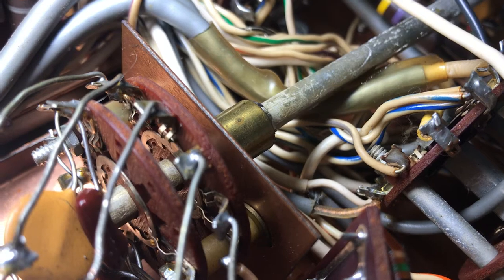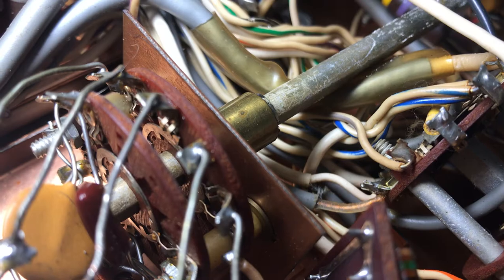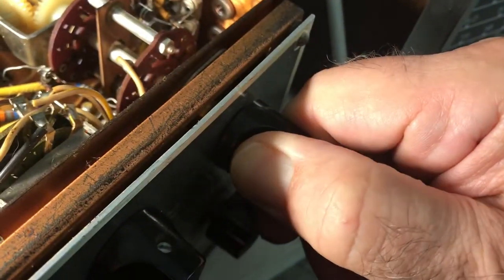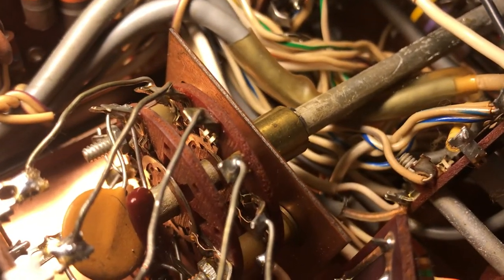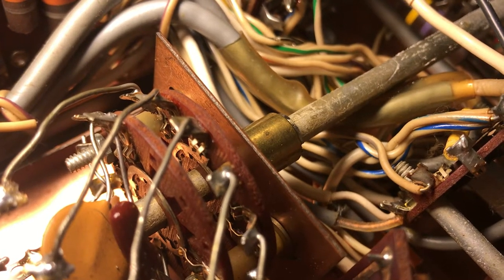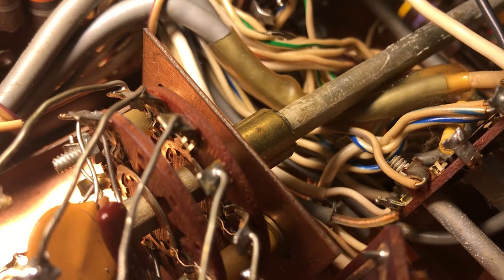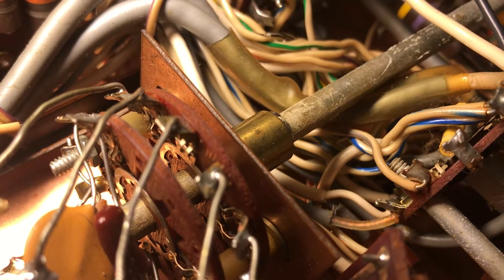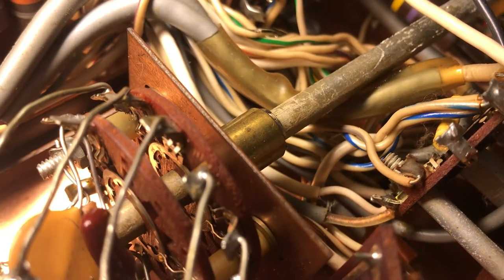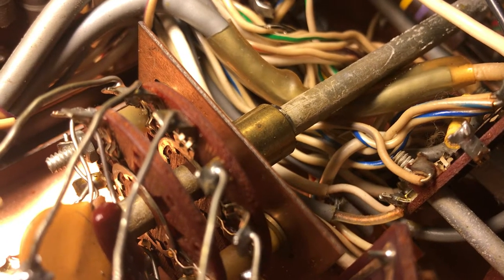I think that's a weak linkage in this radio — this odd band switch arrangement. When some bands don't work you have to fiddle with this thing a bit. I'm rocking about this much and you can see there's no effect over here at all — the shaft is moving a lot, so this is really worn. Maybe it could be fixed with cement or I could put a pin through here. The switch is bad.